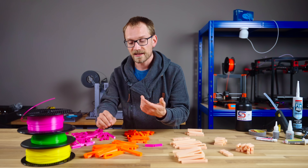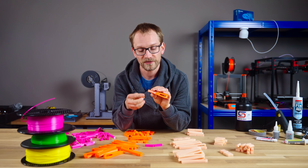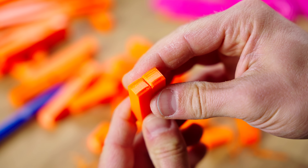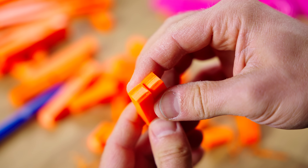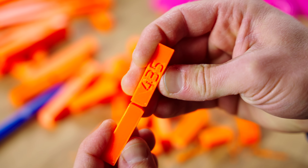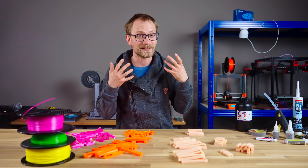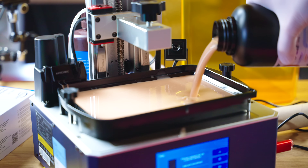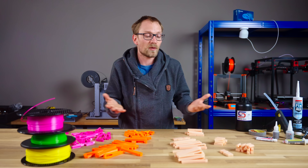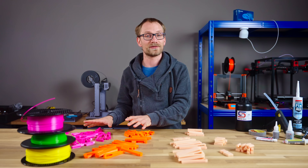One of the challenges with 3D prints is that they're not always going to fit perfectly together — you're always going to have a bit of a gap you'll need to fill. So I've printed two different variations: one set that sits together perfectly flat, and another set with a controlled radius at the joint that sits tight at the center and opens up to a 1mm gap around the edge. That's a good benchmark for how well these adhesives fill gaps. The resin test parts were all done on the Anycubic M3+, and because it had a larger bed, the resin prints completed much faster than the filament prints.